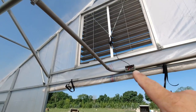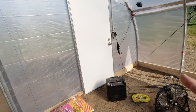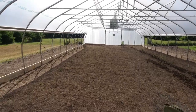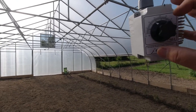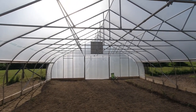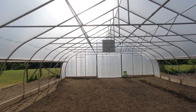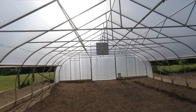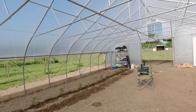This is another reason right here — these are automatic louvers. They're powered by a 12-volt DC motor wired through here to a thermostat. Let's go down here and I'll show you the thermostat. So the thermostat is right here and you can set the temperature you want. I just set it at a higher temperature — see, it's closing. So if I want it hotter in here, like in the winter when I don't want 55 degrees, I can set it accordingly. Now they're going to open back up — opens one side, then the other. The louvers are open on both sides, which is super cool.